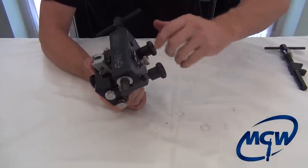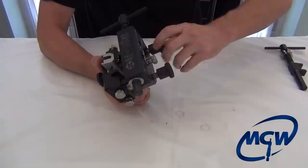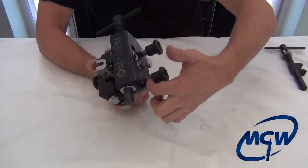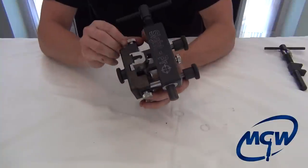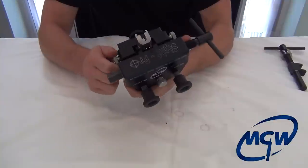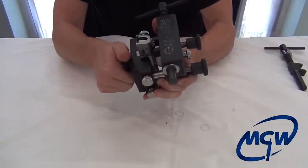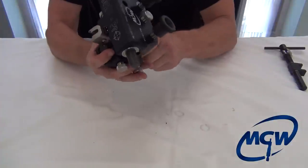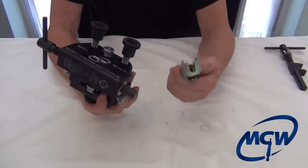Break this loose, and on this one I'll show how we don't have to take the top carriage completely off — just raise it up about half an inch of clearance. Then reverse the process: pop the little side support knobs out, break the shoe just a couple turns, and the slide comes right out. And you are done.